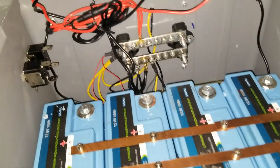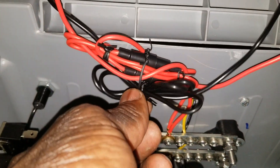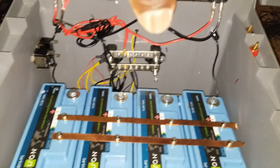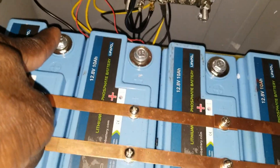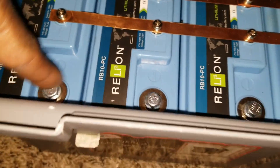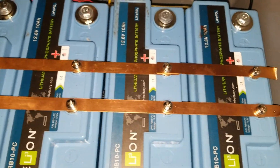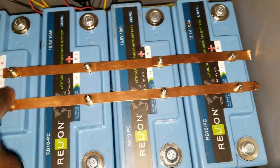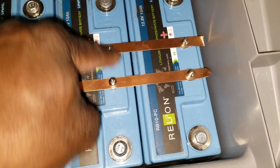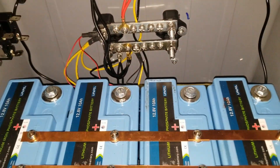So if we close it, it's gonna be protected — maybe I'll use a tag to hold it in right here so you can play around. But this is how it's gonna look: nice and neat. We have to connect the main terminals: positive to positive to positive to positive, and negative to negative to negative to negative. It depends what we want to do. We'll probably remove these bus bars and tie individual wires to the bus bars — all positives and all negatives — so we can have proper contact and connection.